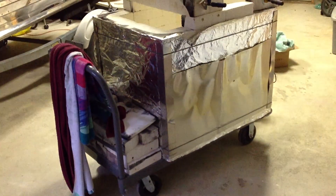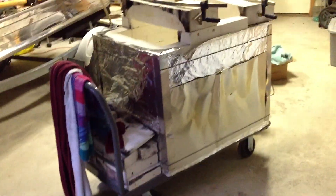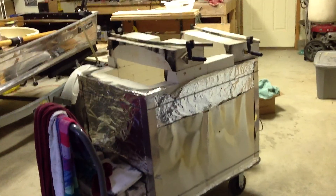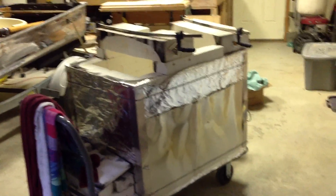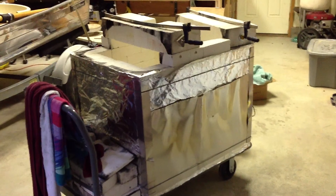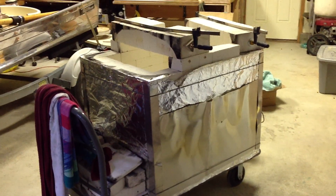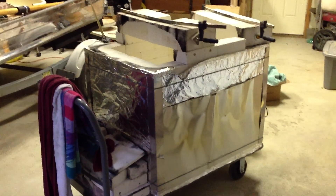The bottom probably ought to be made out of hard brick — these IFB bricks are probably going to deteriorate, but they're holding up for now. The kiln works well; it fits the need I need. It's fairly cheap, it's gas so I get the gas atmosphere, and it fires very quickly. It works under a wooden porch because it doesn't have a stack, I can roll it out my door, and I can wheel it around to make room for things. When I'm not using it, I take the lid off and put a piece of plywood on top and it's a rolling table. It's very versatile, very inexpensive, very basic. I can take the thing apart and build it back together in a day if I need to. That's my little updraft garage kiln for my garage studio.